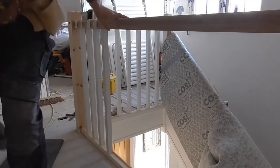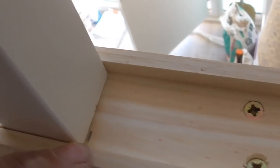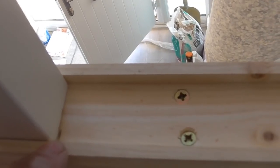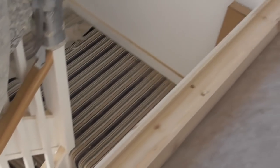You can see we're just coming off the line — it's only a pencil width, but we're starting to come off a little bit. So if I'd have cut all of these spacers, by the time we've got four or five in we'd start to get quite a few millimeters out. What I'll do now is just leave the next spacer half a pencil line thicker, and then we should keep on this gauge all the way down and not get too far out. We know that when we get right back to the last one, that end space will be 90 millimeters from that spindle to the half-newel.